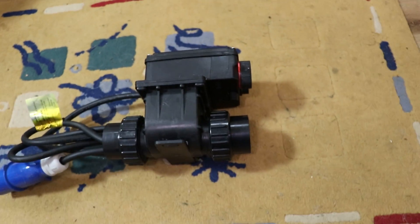I put my ear to it and you can hear the little thermostat click on. So what I'm going to do is just give it a little bit of time and see if it comes up. We're still at 18.5 degrees. It might be interesting to put this on the pipe at the other side of the heater - so that registers 20.5 and then that registers 19.1. So it does work then. It is 20.5 degrees coming out of the heater and 19.0 going in. So that gives you a good indication that the heater's actually working.